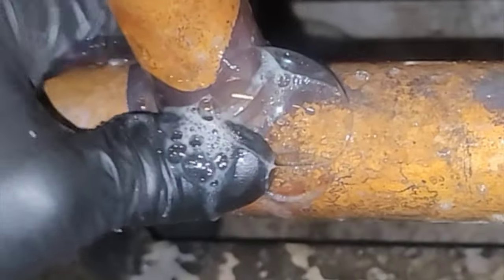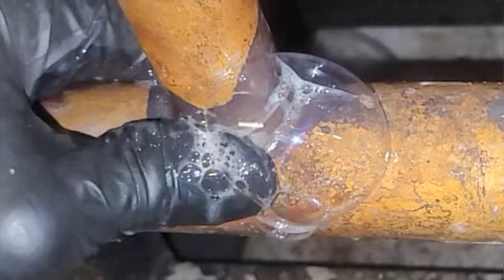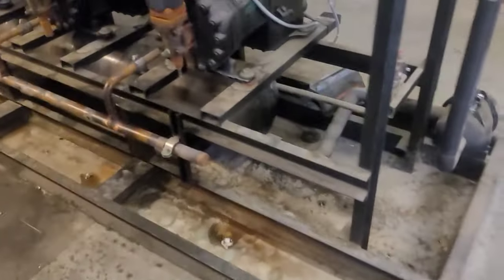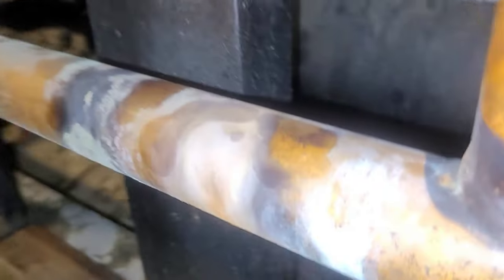Last year on August 27th, I had this call where the rack lost all the refrigerant. We had all the cases on this rack down, and I barely caught this rack when I got there — it was seeping out the last little bit of refrigerant. I found the leak on the middle discharge line coming out of the compressor where it joins with the header.